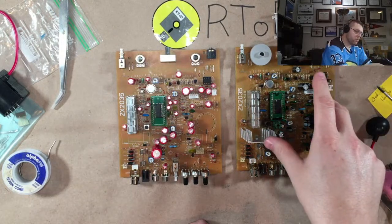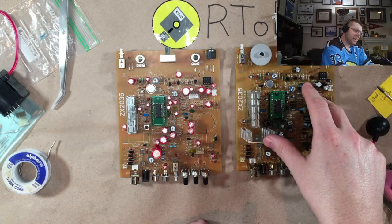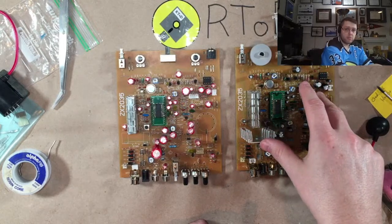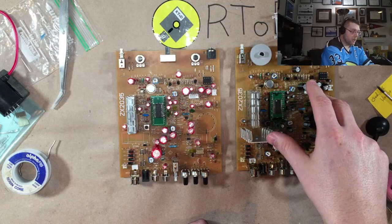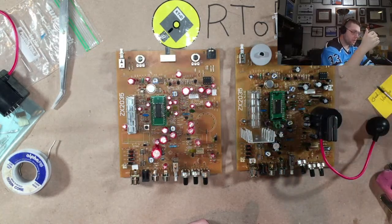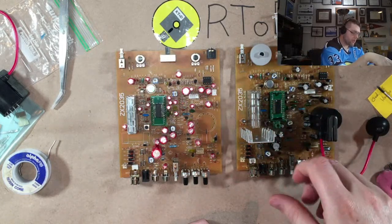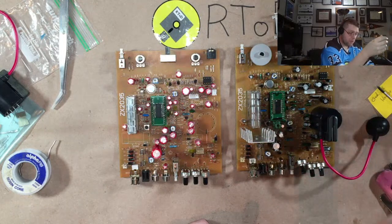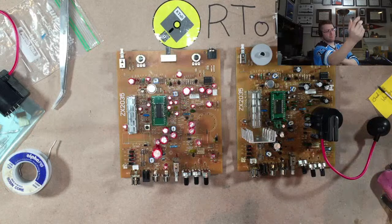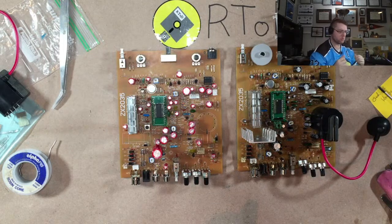There's two transistors on here, D880 I think, and one of his exploded, right? It just blew up on him. So he replaced it with a newer transistor and everything works. He noticed that some of the adjustment pots on here, and this is something I picked up on early on, just don't work, right? So we're in the process of talking about what parts we want to source to replace that.